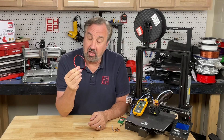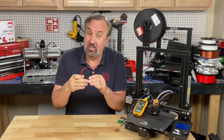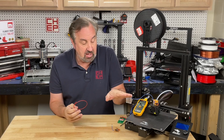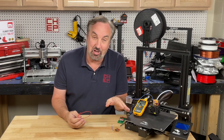When you're printing with PLA, the glass transition temperature is 50 to 60 degrees C. That's the point where the filament actually starts to get soft — it doesn't melt, but it just starts to get a little bit soft. That's why we make our beds 50 to 60 degrees C, because it softens that first layer so it sticks and doesn't want to lift off the bed.